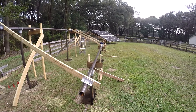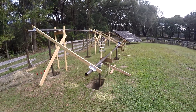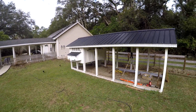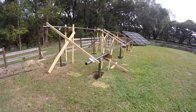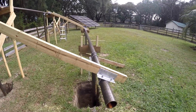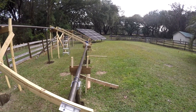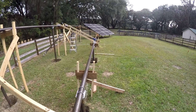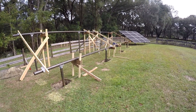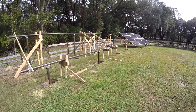The next step is putting the 2x4 rails on. I'm only using the 2x4 temporarily because my IronRidge rails are still in production on the roof and I want to minimize downtime — normally you'd use your regular extruded aluminum rails. The key is that the distance between the front and back rail must be the same all the way across. If you're straight, level, and the distance is consistent across the whole rack, you're in good shape. I also measure at the base to confirm equal spacing there too. I'm going to tweak this a bit more today, finish the scaffolding, and we're pouring concrete tomorrow.